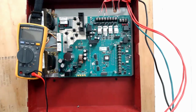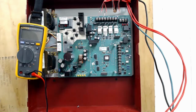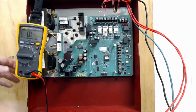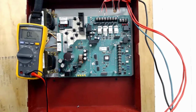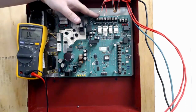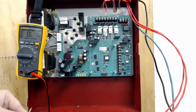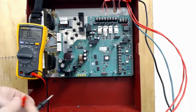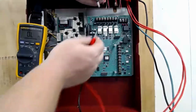And if you remember back to our meter demonstration video we did months ago, that's going to use the ohmmeter setting on the multimeter. It looks like the Greek letter omega. And this is only to be used when circuits are not attached to a board. So you see I have them out here. They're not attached to a board. If I touch the 2 right here, that tells me it's a direct short. So I know my leads are working, my meter's working, and I'm going to just go through each one.